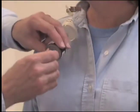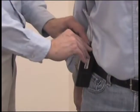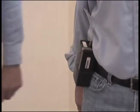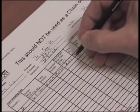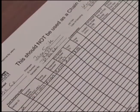Remove the nib from the inlet side of the front filter cassette. Turn on the pump and record the time to the minute that you started the pump on the field data sheet. The counter records the minutes the pump is operating and should read zero when you start the test.